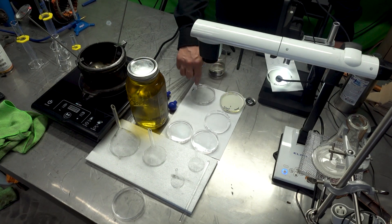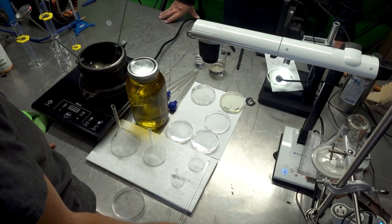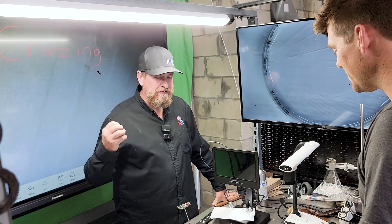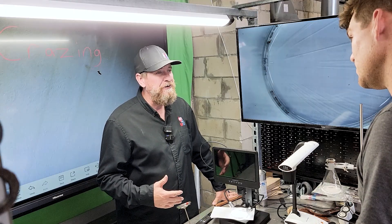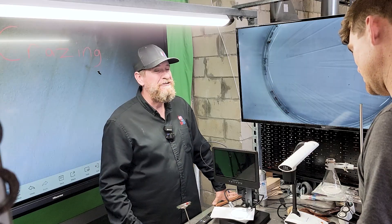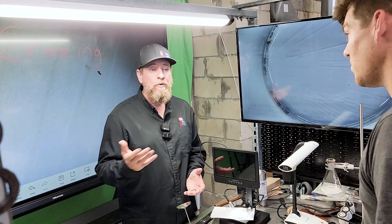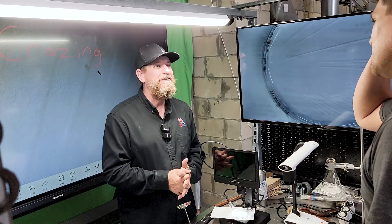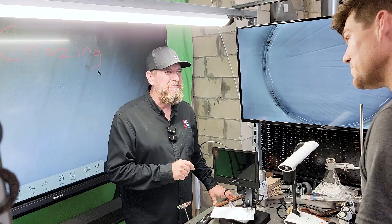Interestingly, mineral oil didn't do anything to this type of plastic at all. We had a compressor changeout yesterday where terminals blew out and blew the refrigerant charge and oil all up against the coil. We cleaned the coil because we didn't want acid eating the aluminum — but I wasn't even thinking about what's happening to other plastics around. Especially in VRF systems that have a lot of plastic, something as simple as a cable tie, or pressure transducers — we get oily hands and touch that. We need to be a little more careful when working with oil.